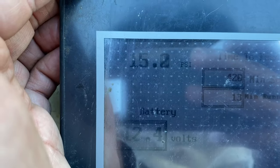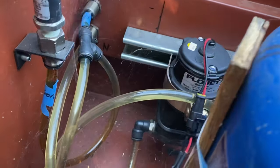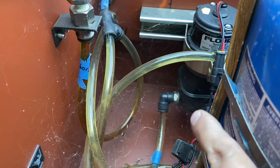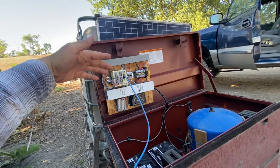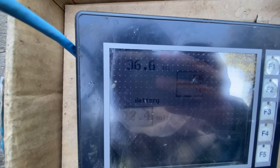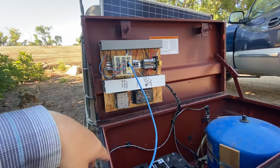It's at 15 PSI and starting to drop. Can you hear the pump turn back on? I've modified the pump to have push-to-connect fittings directly connected to it, because otherwise I'd need adapter after adapter and I hate that. There's also a special little valve inside that I built so that the head pressure doesn't push fluid back through the pump - it physically has to go through that valve. Like I said, if you guys are interested I'll go more into it. Looks like it's working.